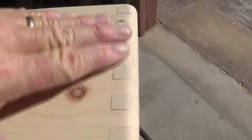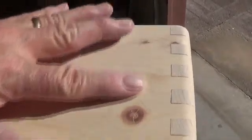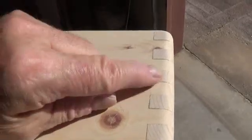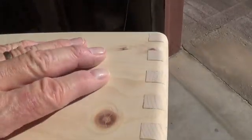Also be sure that your box joints are completely smooth and leveled. If they're a little low, you can use some wood filler. If they're a little high, you can sand off the high spots. They should feel when you run your finger along it just like you're running it along a plain plank that hasn't been finger jointed. Otherwise this will really show through the covering material. Those of you who've seen old amplifier cabinets where the wood is shrunk — you can see the box joint along the corner. That's all quaint and nice, but on new ones, if you've done your job properly, that shouldn't be there.